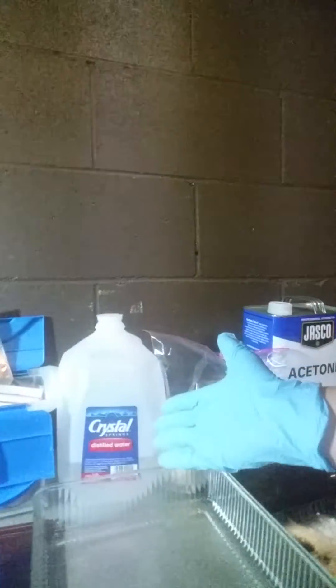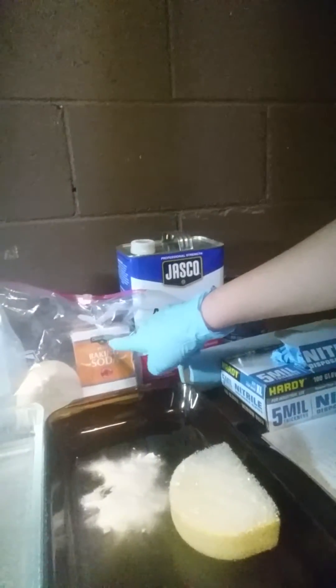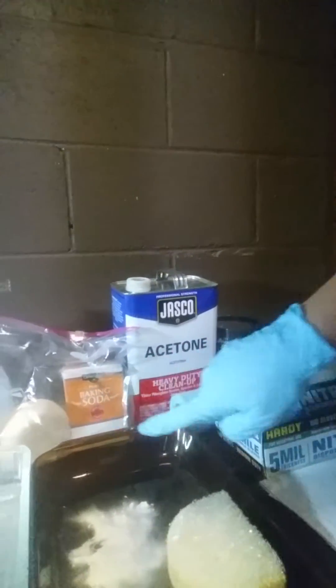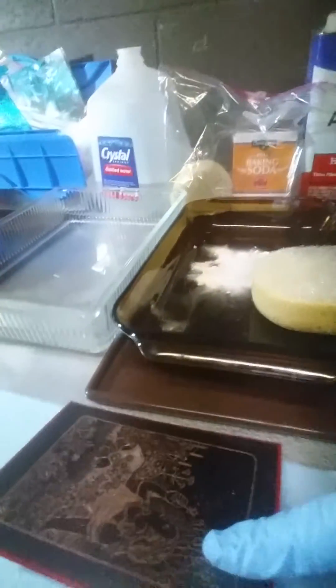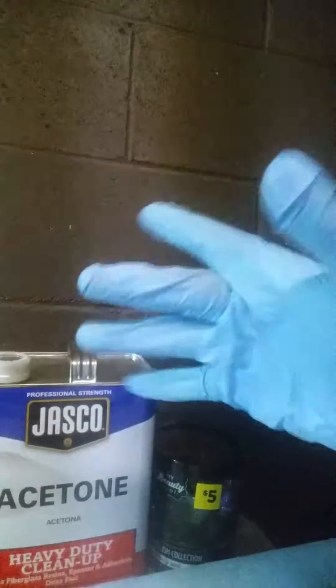Following that I will use distilled water to rinse. I have a rinse bath here, and then I have to neutralize any acidic action with a base — which is baking soda — mixed with distilled water, and I'll scrub it to neutralize any continued etching action when I feel I am done. To remove the resist from my copper plate and the nail polish covering the back, I have acetone and of course rubber gloves.